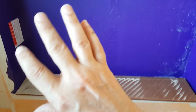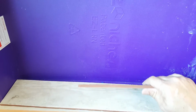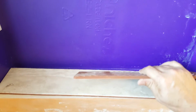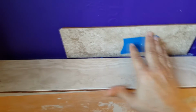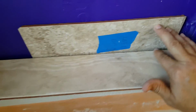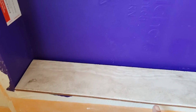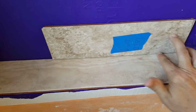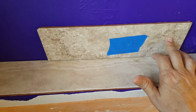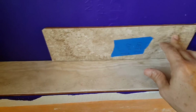Right, so now we want to go over with you which order we put these tiles in on this niche. And believe it or not, yes, there really is a pecking order of what order you put them in. So I've seen people do it in several different ways, but I believe that my way here that I'm going to show you, that I've been using for years, is the better way to do it. Some people, I think, make the mistake of thinking, well, you got to put the back piece in first, and then you put this one up in front of it. But see, the problem is now you have an upward facing grout line here, and I think that's a big no-no. The best way to do it is you got to look at the way the water is flowing, and what it's going to do is, I think you should have the bottom piece in first, then the back piece goes on top of it, and there's no grout line. So you just do a thin bead of caulk along the bottom there. And so water is going to hit this back piece first, bounce down and hit this and roll off back into the tub. That's the best way to do it.